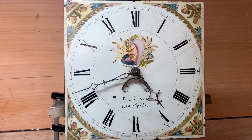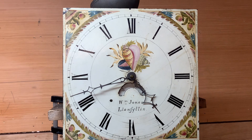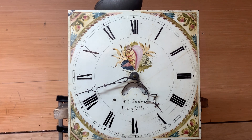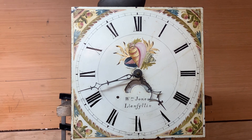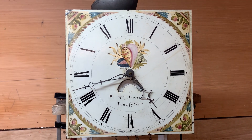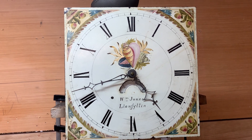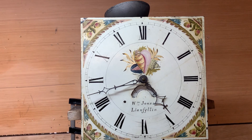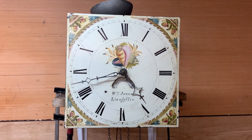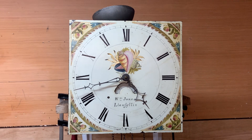This is a 30-hour clock, so it's wound to last 30 hours. The idea is you're supposed to wind it up within 30 hours and it should keep reasonable time. The strike on these is a count wheel type strike — so if you didn't wind it up every 30 hours and left it for a few days, whatever time it stopped, that's near the hour where it's going to strike, so you'd have to adjust it again by lifting the lever on the strike wheel to advance it to the right hour.